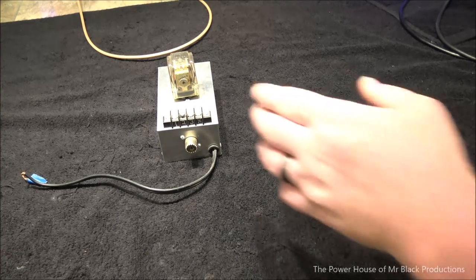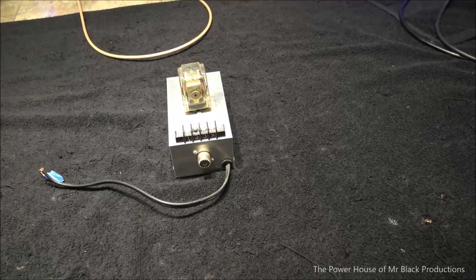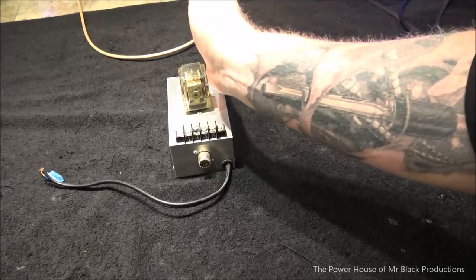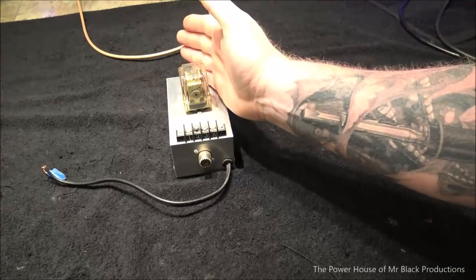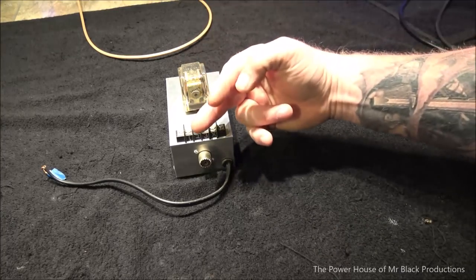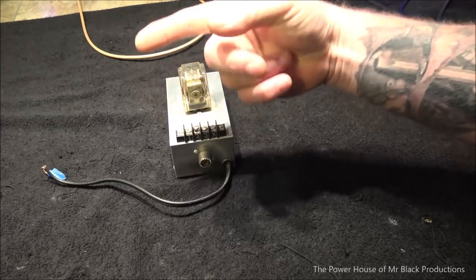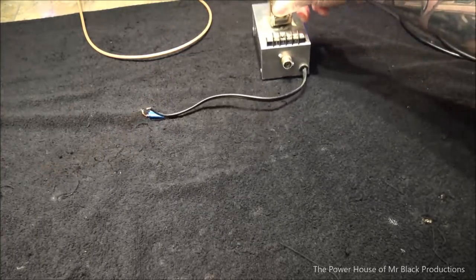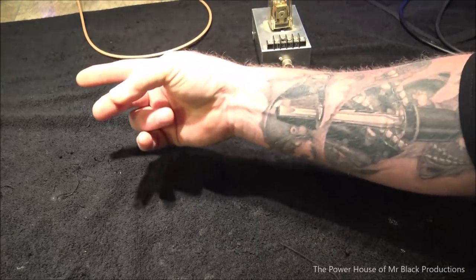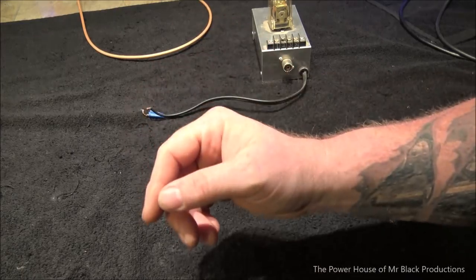that's great if you have two devices that are inherently mute. What I mean by that is the receiver just receives and the transmit just transmits. If you have two radios, which are transceivers, that means they have the ability to transmit and receive internally, you're going to have one radio that's going to be in receive when the other unit's in transmit. Think about it for a second.